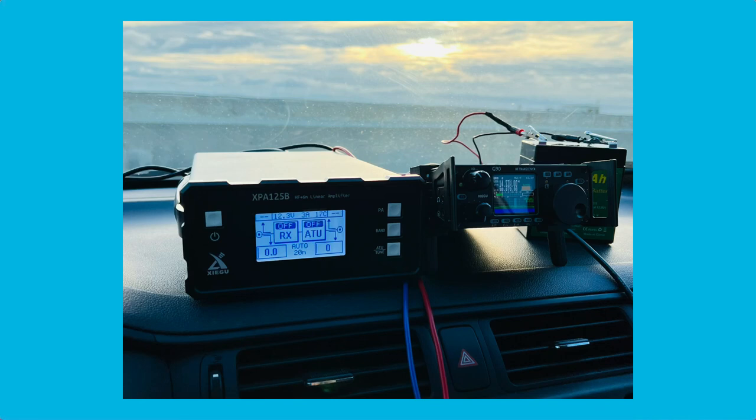Right out of the gate with the first QSO, I had an issue and it wasn't with the antenna. I'm running 100 watts here with a little amplifier next to my Xiegu G90 in the car. On that first QSO, I was getting high reverse power on my amp. I've got pretty short coax to this Wolf River coil and the mag mount up there. I'm going to put on a choke — a one-to-one balun — and see if that helps. I keep getting the high reverse power on the amp, so the amp's going in the bag. We're just going to work 20 watts.